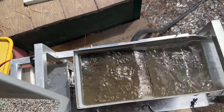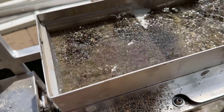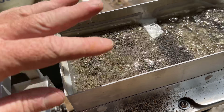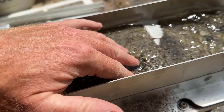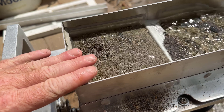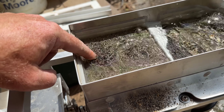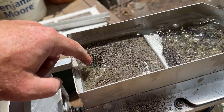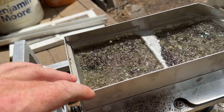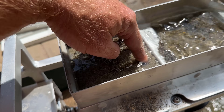It's definitely pulsing. Now when you're using this machine to recover gold, you actually have metal shot — little BBs of metal — down in there. Because gold is heavier than steel, the gold settles through it. Right now I'm using the garnets themselves as the media down in there to start separating. The garnets should go right to the bottom because they're the heaviest. If this doesn't work, because you can see it's got a fairly significant blow-through, I can turn down the water levels a bit, or I can put the shot in there to disperse that water. I have a feeling this is doing what it's supposed to — I think it's still separating the garnets. It feels really loose; heavier stuff should fall down no problem.